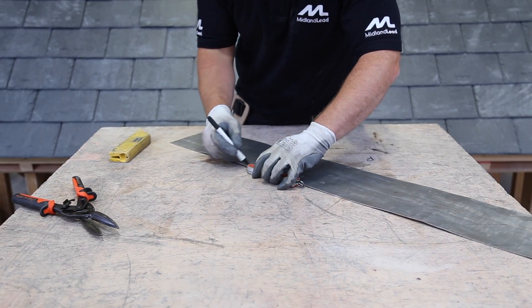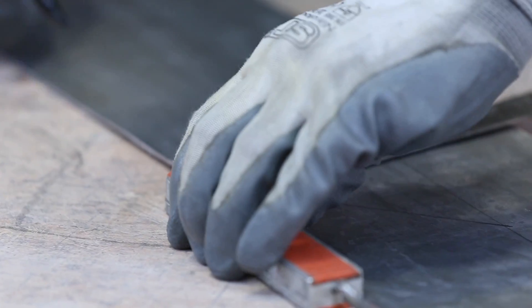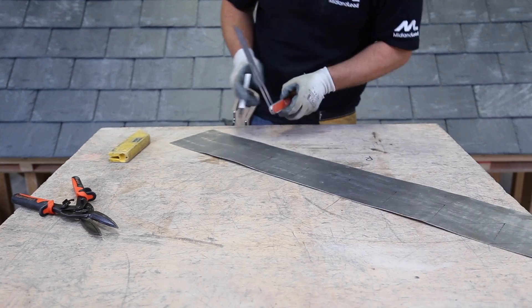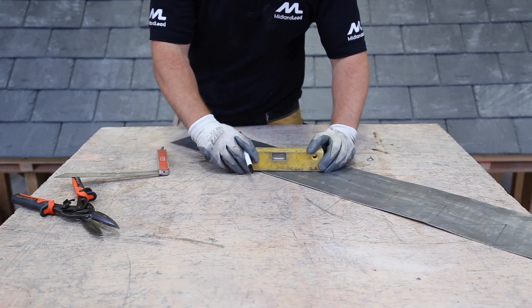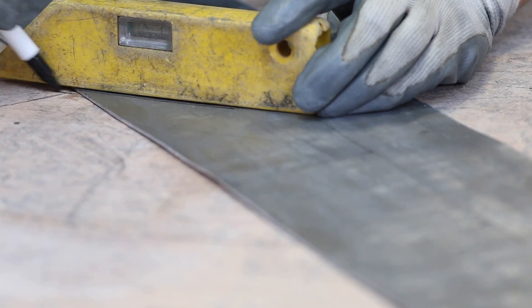On your workbench, you'll then need to mark each step by drawing a line from where the watermark and the joint lines intersect, through to the outer edge of the next joint line. Use a bevel to ensure a consistent angle. Next, mark the turn-in 25mm above each joint line, from the outer edge of the lead to the step line.